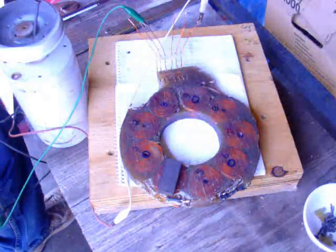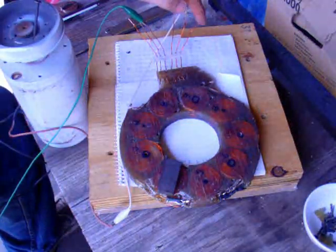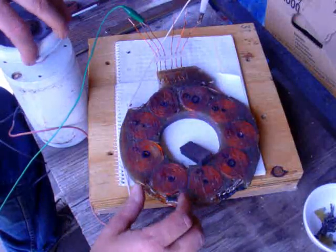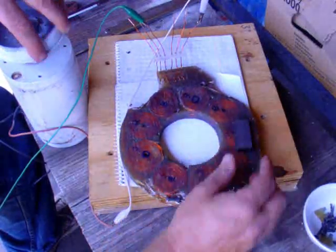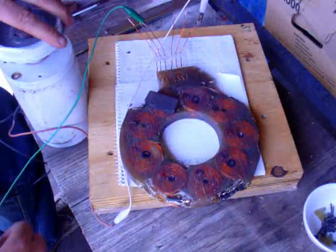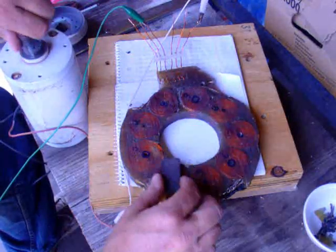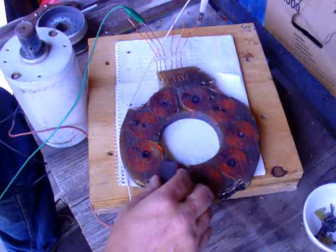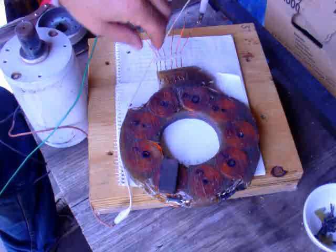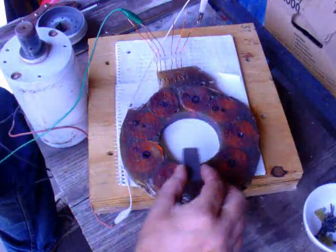In order to troubleshoot this just a little bit farther, like right here I have this on L3, and you can see how the magnet doesn't want to stay there when I'm just turning this little DC motor here. Oh my goodness, you can see how that jumps around there, but it doesn't here, it doesn't here, but it does here. When I hooked between these two wires and I hooked between the inside wires, I got 1, 4, 6, and 9 all did that. That's not right.